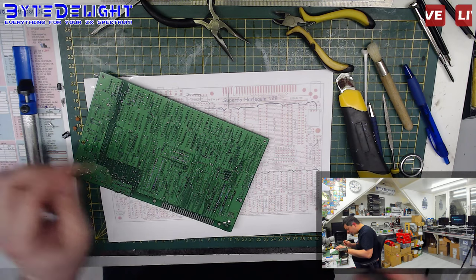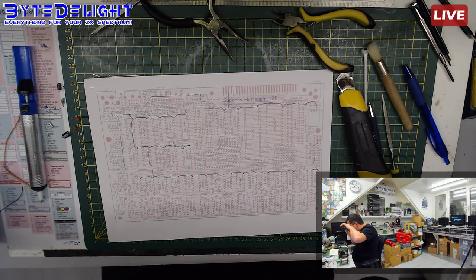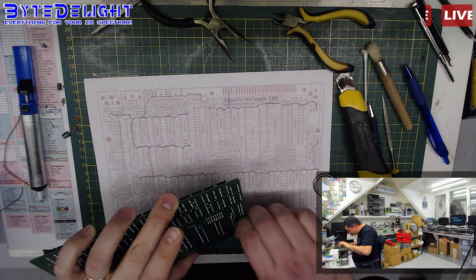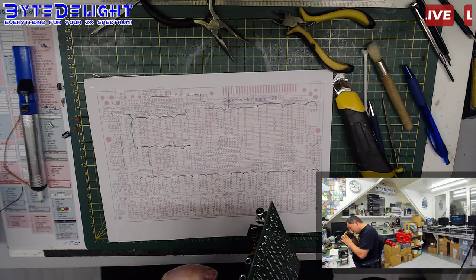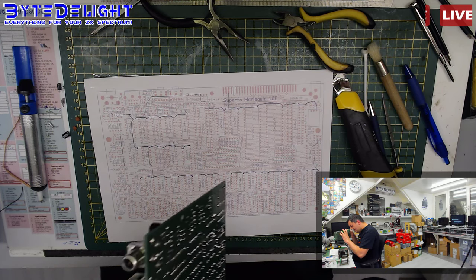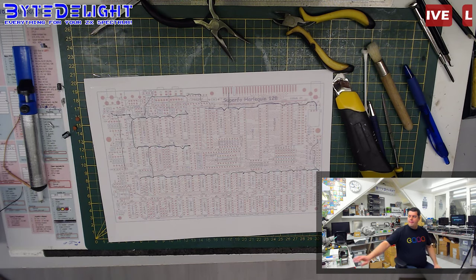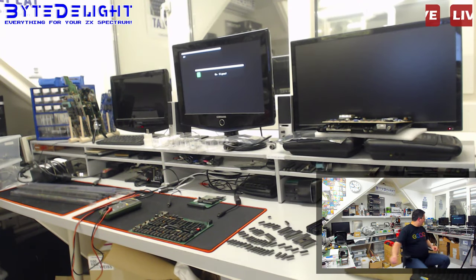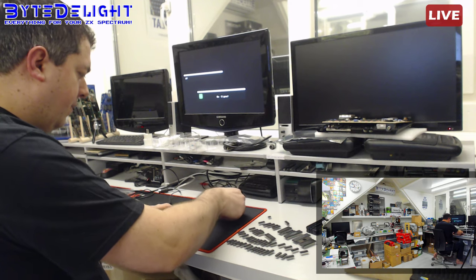Alright, so the only thing that's in now is the 5 volt regulator. And I say again, I tested it already. So it couldn't be it, but what else could it be, man? Now I must say I don't like the solder of the input wire of the voltage regulator, but I cannot think that that could be the cause. We still don't have any 5 volts, so could that be it?